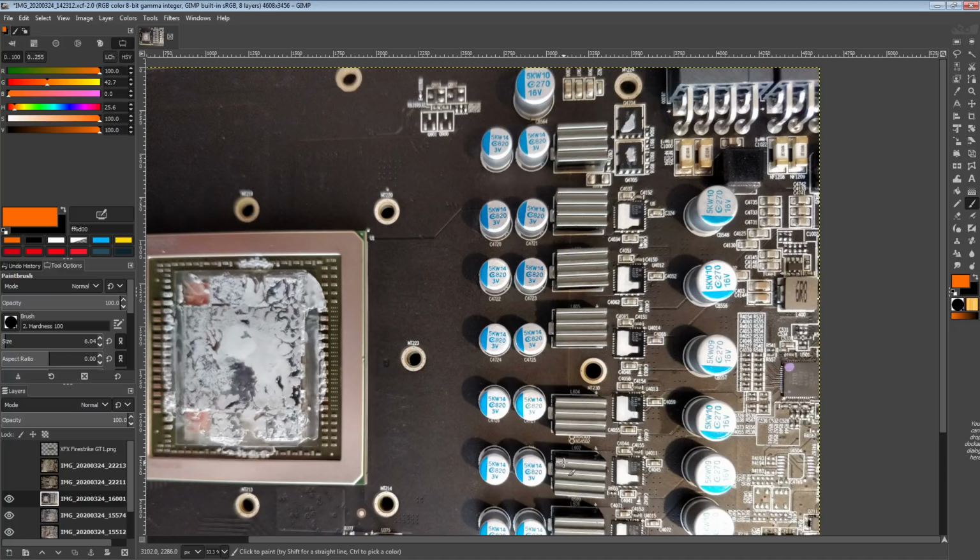If you have the choice between a single 22 microfarad cap and two 10 microfarad caps, unless you absolutely need, well, okay, no, that's not a great example. But if you had the choice between one 100 microfarad cap and ten 10 microfarad caps, it's a very simple choice. 10 microfarad caps are better. Unless they're exceptionally terrible, you're going to get a better result with the 10 microfarad caps, because if they're 10 milliohms ESR each, their effective ESR when all hooked up in parallel is going to be about 1 milliohm. Whereas your 100 microfarad cap, even a good through-hole one, will be like 5 milliohms ESR. That's 5 times more ESR than the 10 microfarad caps in parallel. So in a lot of situations, sheer quantity of caps can end up being just better.